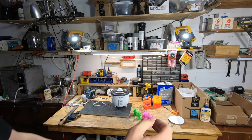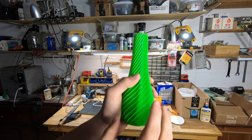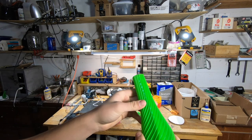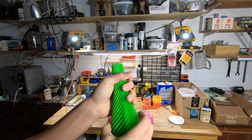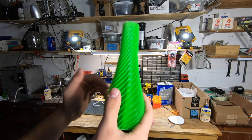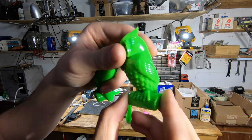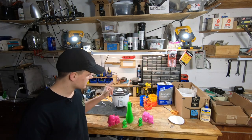This is a pretty heavily acetone smoothed one. This one wasn't very heavily acetone smoothed because if you acetone smooth thin-walled stuff they tend to kind of melt and bend. But this vase — normally before acetone smoothing if you did that it would either snap in half, and these fins here are really flexible. That wasn't something I could do before acetone smoothing it, because it melts the layers together and just makes it a stronger and more flexible part. These little owls — the one with supports still looks a little rough but a lot better, and this one without supports looks really good and really clean.